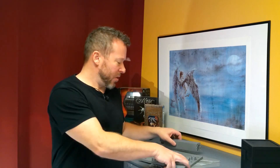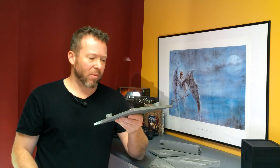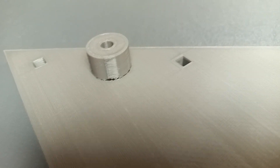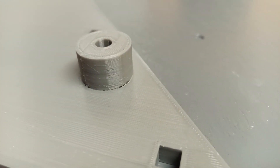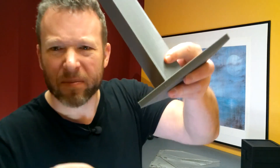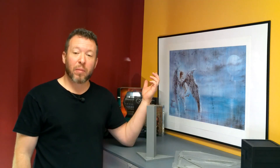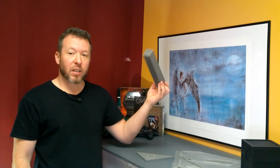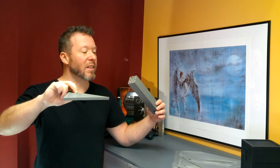Now we get to the more interesting parts. When I designed this flat surface with these stubbies on it, the printer for some weird reason does not print from the vertical to the horizontal without leaving a gap — unless you add a fillet, which I did here. There's a little fillet right there. And that was a cross-member in the back. But then due to the vibrations of the printer, this snapped clear off right above the fillet. So that didn't add any more stability.